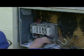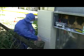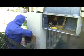Now Stefan disconnects the wiring and holding screws. He then re-wets the area as some parts of the asbestos board are still dry. He carefully removes the wet asbestos and places it into the disposal bag set up earlier. He also wets and then disposes of the small package board. Then he cuts the unwanted wiring and removes the wetted mounting board and puts it in the waste bag.